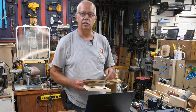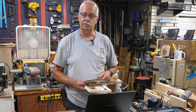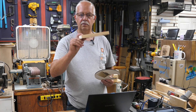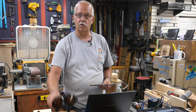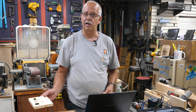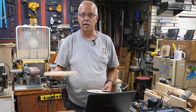This was just a quick video to go over some cut settings and how, by increasing the speed and then increasing the number of passes, you reduce the amount of scorching and the amount of detail being blown out or starting a fire. Always be in the area of your laser when you're using it. You don't have to stand right there and gaze at it, but make sure you have your safety glasses on. Always be in the area just in case something happens — although the laser did shut down like it's supposed to with the flame detection, this was still burning when I came over and I had to take a hose and put it out.